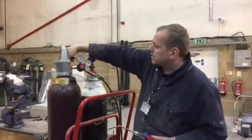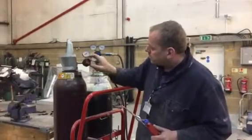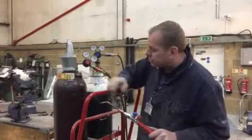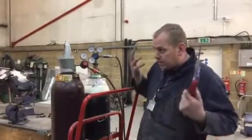Shut it down. It'll be exactly the same with the acetylene. Turn it on, wind it up. If it's too far, release the gas and the gauge drops. Because it's on, just reset it to 0.5. That's the working pressure — that's the gauge setup.